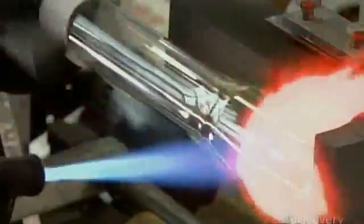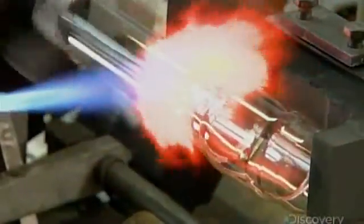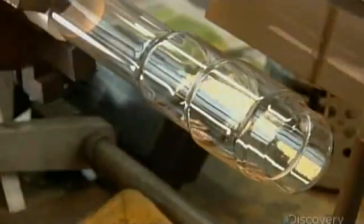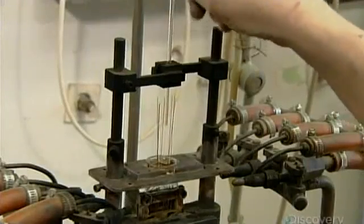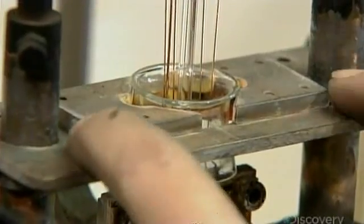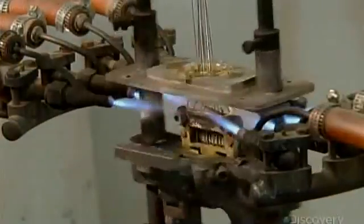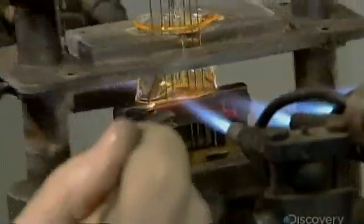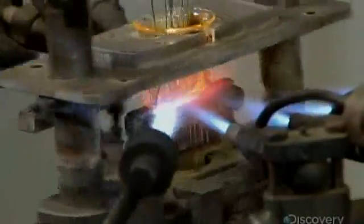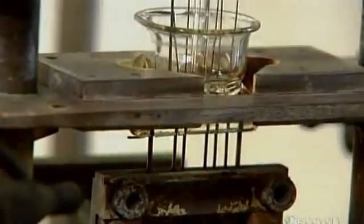He blows in just enough air pressure to keep the bulb from collapsing inward. When the glass reaches just the right temperature, a die presses against it, setting the final shape. Next, they mount a glass collar over copper wires clamped into a motorized vise, then insert a glass straw called an evacuation port. As the vise rotates, they heat the collar uniformly with stationary torches. Using a handheld torch, they remove any stretches or runs in the softening glass. When the time is right, they activate a die to press the glass into the final shape. This completes the stem on which the tube's inside structure sits.